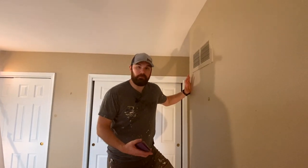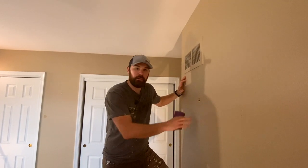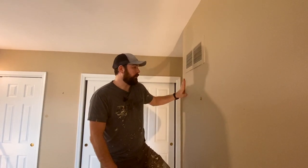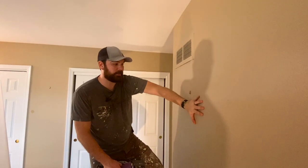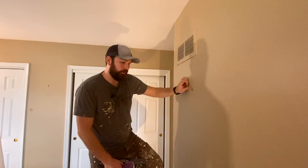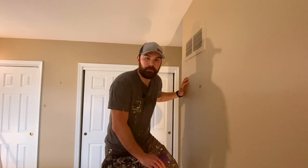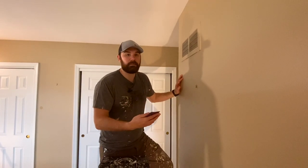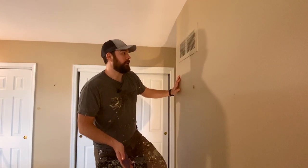The reason we sand is because there might be leftover nap from whoever rolled before us, or little bumps and rough spots in the wall. When you paint, you want your walls to be as smooth as possible. If I rub my hand over this, I can feel a lot of rough spots from the little naps and dried old paint. We want to knock that down, and then when we get into spackling, that's when we really cover the bigger bumps.